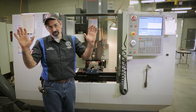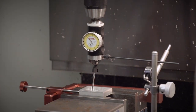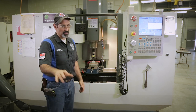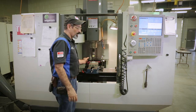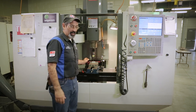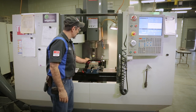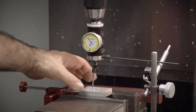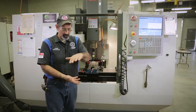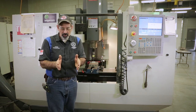We're gonna pretend that's the G54 on this one. If not, I could move over and figure out where it's at. I don't have the print for this block in front of me right now, so I'm not sure where the G54 is at. We're gonna treat it like it's in the middle. This also could be used if you're picking up a raw block even, and they say put the G54 or home right in the middle. You can do what I did on that first block. You can swing the outside and this outside. Doesn't matter if it's this big or this big. As long as you swing it in the middle, you're good.